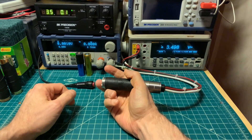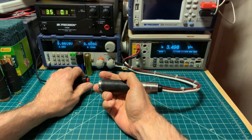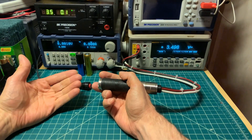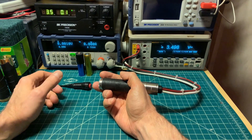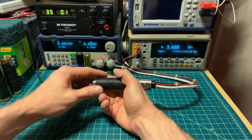What I do now is I fire — I close the contacts, or press the button — and then I fire a two-second pulse through here. What that does is prevent any arcing damage from occurring, which might affect my results, especially if I want to retest. I'll be doing arcing testing and its effect on overall resistance and conductivity at some later time, but right now it just provides more consistency because there's no arcing damage building up during the test.